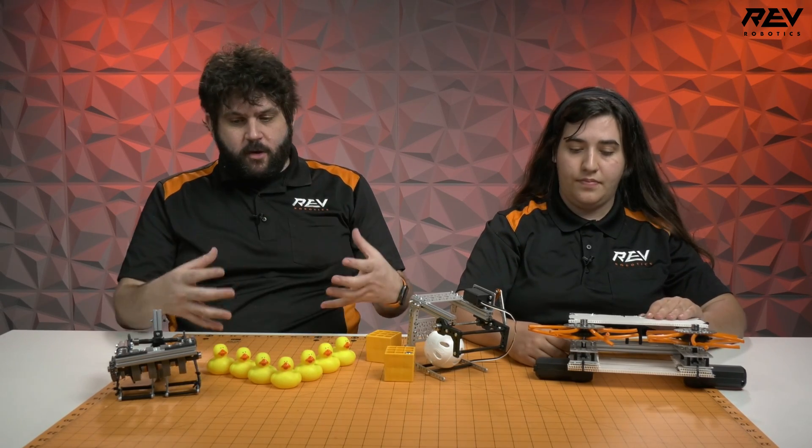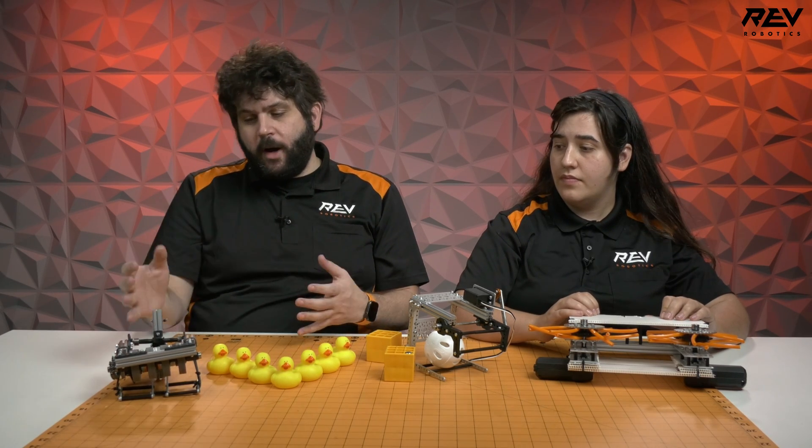The next steps: I think we've gone as far as we can go with claws. They will work, but there's a lot of precision driving required to make a claw work. If you're getting started, it's a great place to begin, but you really want some type of intake that has a lot more compliance. Based on the success of the roller intakes, we'll probably do a bit more iteration on these. Hopefully what we've shown here suggests that some type of spinning intake to gather and bring objects toward you might be something worth looking at for your robot.